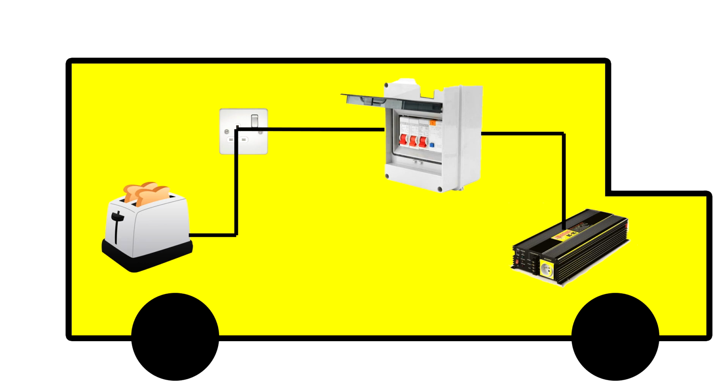And then when I go to shore power, my shore power connects to my inverter, and then my inverter decides to convert to shore power, rather than having it straight into the back and having a physical change lever. But if you did have a physical change lever, it would probably be a very similar setup to this. And of course this is not a wiring diagram, so don't use this to wire your vehicle. It's very rudimentary. I've obviously missed lots of components off this, there's no batteries there, etc. This is just to illustrate my point of earthing to the chassis.